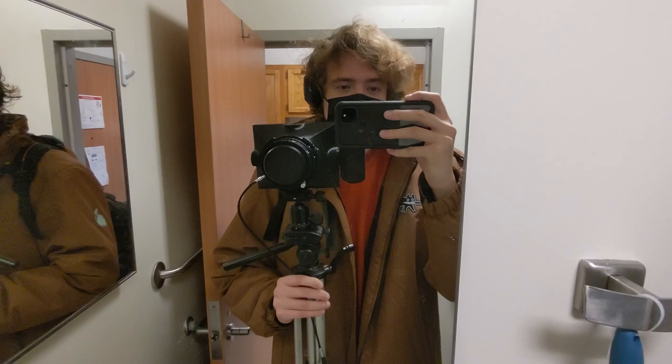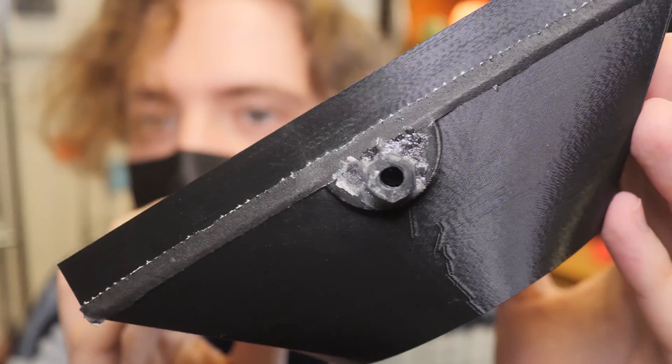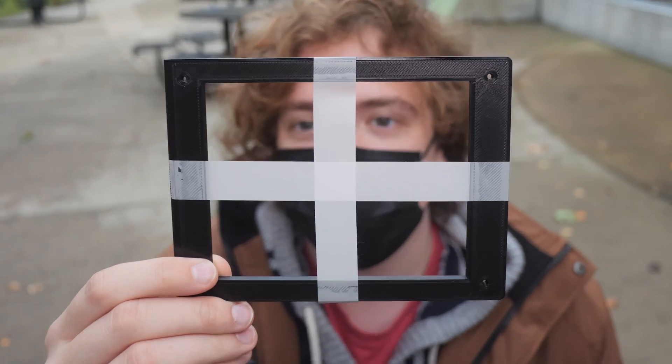I was ready to go out and shoot and see what kind of results I got. I'm out here with the most jankiest testing setup I've ever conceived. In terms of the camera body, everything's looking pretty good. Thing is, I didn't make a tripod mounting screw hole, so I super glued a nut to the bottom of the camera. Ground glass is expensive, so I thought to test stuff out I'd go with as DIY a solution as I can — I learned this from Large Format Friday. It's literally frosted scotch tape, and it actually works pretty well as a ground glass. This is printed at about five millimeters, which should be the depth of the back of the camera to the film in the film holder, so the focus should be similar.